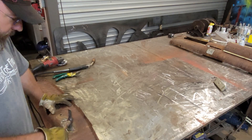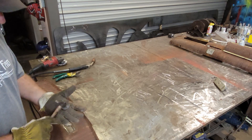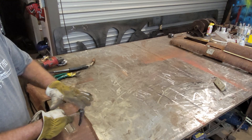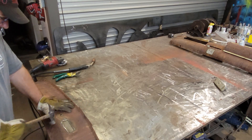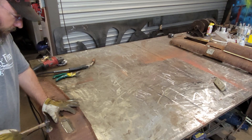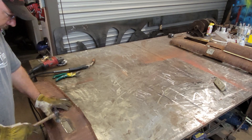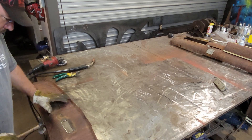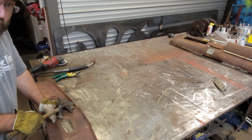You could also use a dolly for the back side with the hammer — it doesn't have to be a body hammer, but it needs a flat head. We just need something to tap this all in place and flatten it out before trying to fit a panel. I'm going to patch that switch hole in as well — that's the switch for the light.